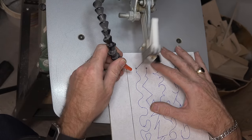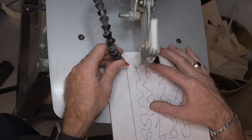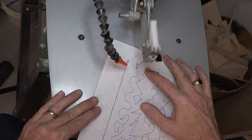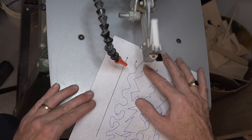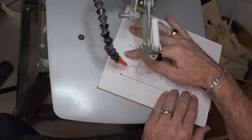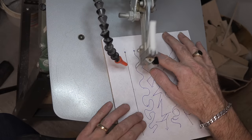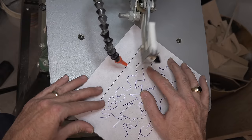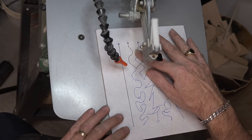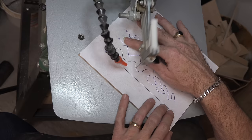The dust blower is set just slightly in front of the blade to clear your pattern. We're going to start cutting with a straight line that comes right into our test, again compensating for drift, and now into the gentle sweeping curve — feed rate faster than rotation rate. Coming around this corner to a more even curve, feed rate and rotation rate are equal. Then into a straight away, so again you're compensating for blade drift. When you get to the tight section, your feed rate will slow down and your rotation rate will speed up to get that tighter curve.